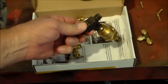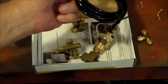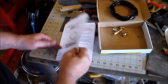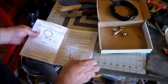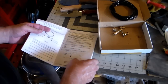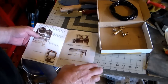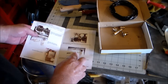I'm going to change some of this out because the included fittings are pretty thin — I have some thicker brass I'm going to use instead. And rather than the plastic tubing, I'm going to use soft copper. The little instruction book that comes with it gives all the information, safety precautions, shows the different components, how to hook it up, and even has colored pictures showing a couple of different configuration options for the bottom of the tank.